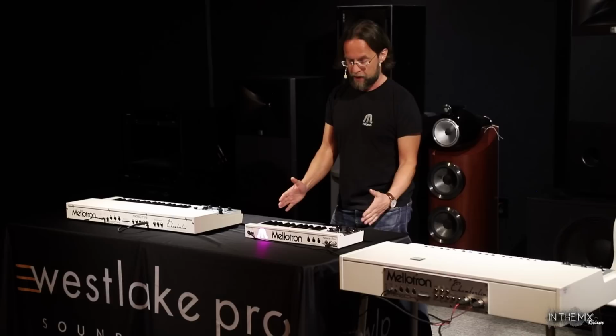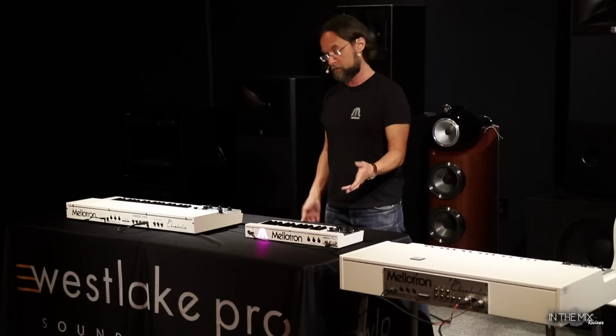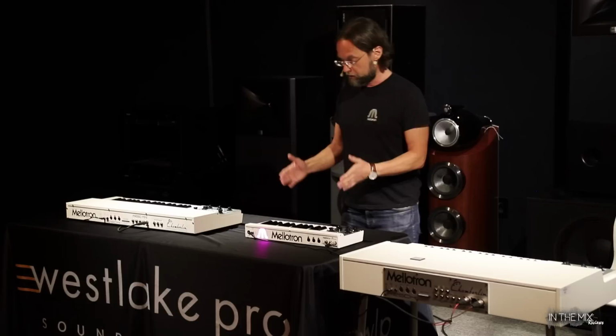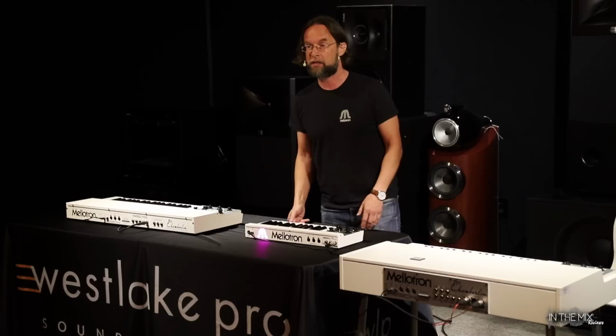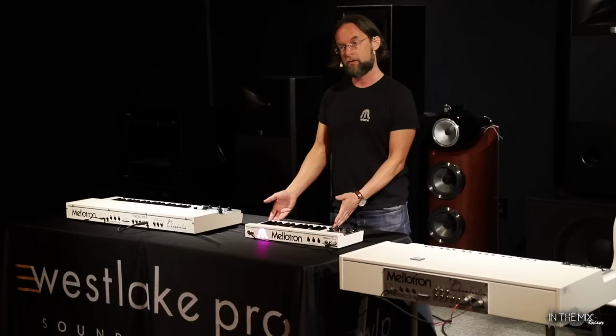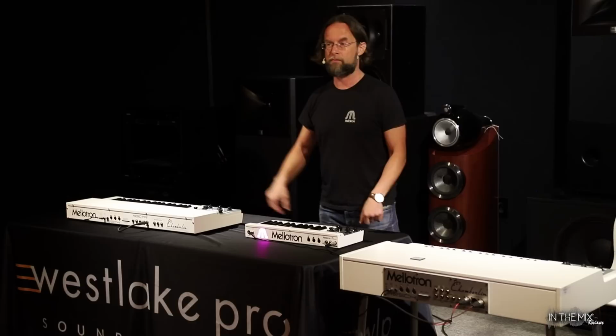But it gives you the 100 sounds of these instruments, but you can't expand it because the bus of the Compact Flash card works differently from the SD card. And it's only a 2-octave keyboard, because keyboards like this you can't order; they're custom made, because the 3-octave F-to-F range just doesn't exist as a pre-made keyboard. So we use a 25-key C-to-C keyboard here, and then we have an octave switch to get the whole range of the Mellotron.